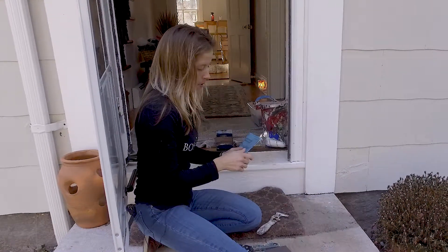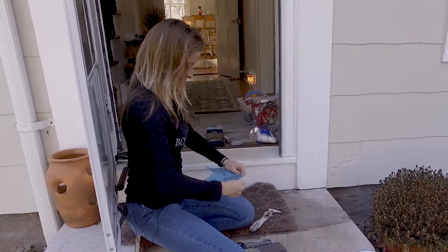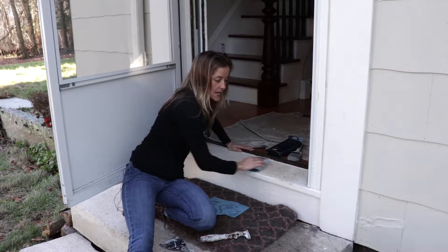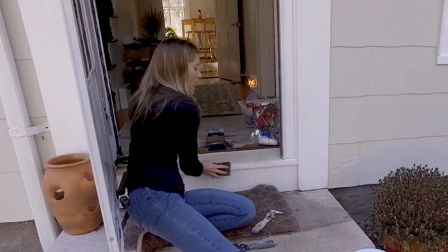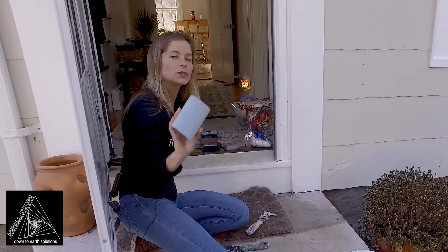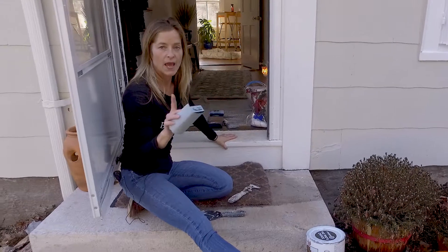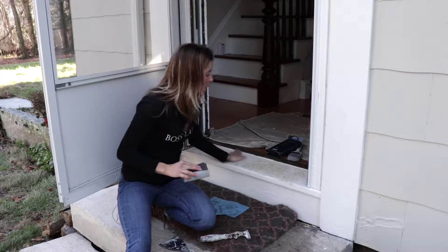This one here is an 80 grit — I just want to show you how these sanding blocks work. A little elbow grease really gets you up close and personal with your projects. Once I've completed sanding with my orbital sanders, I do a hand sand with the sanding block, generally 180 to 220 grit, to make surfaces nice and smooth. If I need to apply any Bondo for heavy cracks or filling, that's also when I do that.